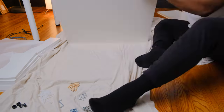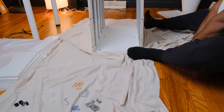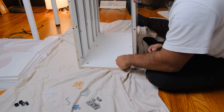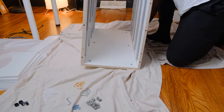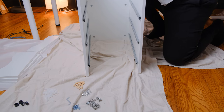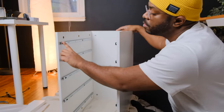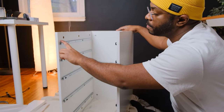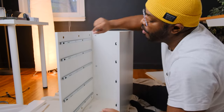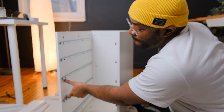This is one of the important parts where you could mess up, because you need to make sure you have this set up in the correct orientation before adding the top and bottom boards. The drawer slides with the least amount of space between the sliders are for the smaller drawers, and the smaller drawers go on top. That is how you know you set this up in the correct orientation.